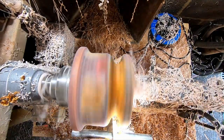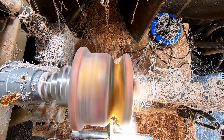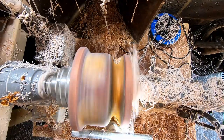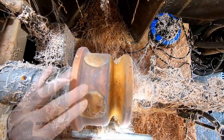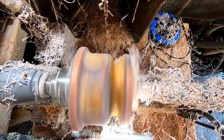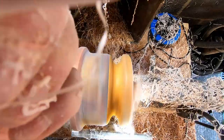With the base roughly to shape, I concentrated on exposing the yew in the upper section, gently removing material to create the overhanging rim and the pinched waist. In this clip you can see some chipping just above the base, which meant I had to take a bit more off than I would have liked, but overall I got it down to the shape I was looking for.